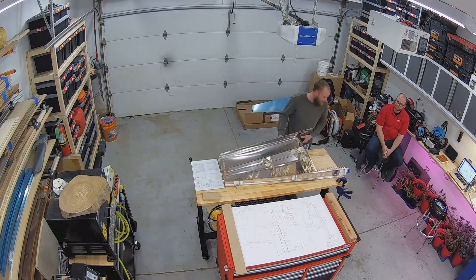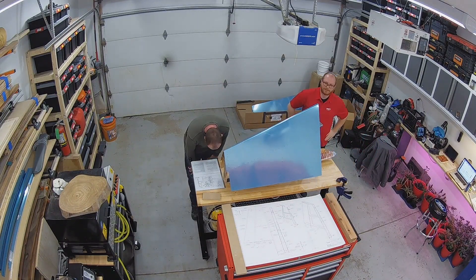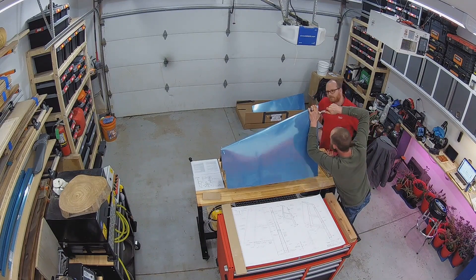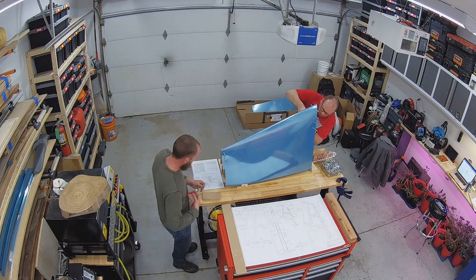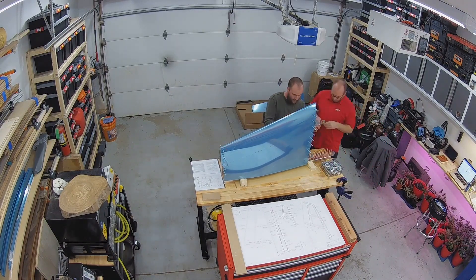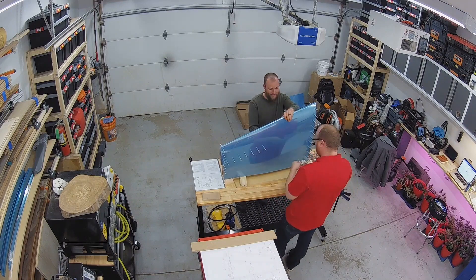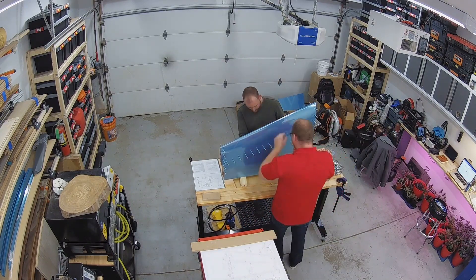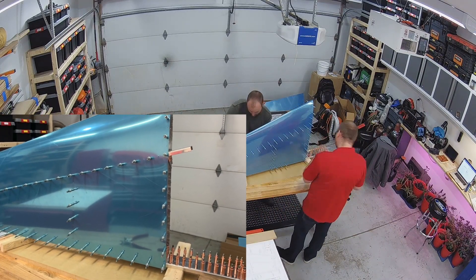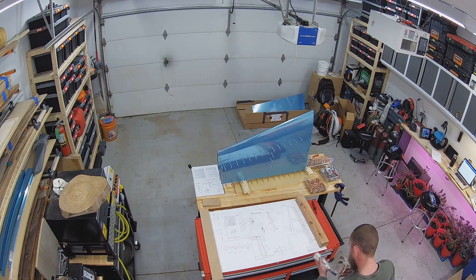I removed only the inside blue film from the skin. Obviously you have to do that so that you get a good fit between the skin and the spars for match drilling, but I left it on the outside just to provide some protection during the entire process. I'll take that off when I get to the riveting phase, but I'll probably leave it on even during the priming phase. I'm still going back and forth about the final finish — I'm probably going to go with a painted airplane as opposed to polished aluminum, so that's why I'm okay with removing that film even on the outside.